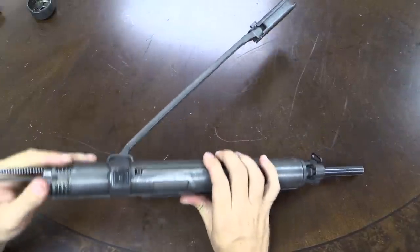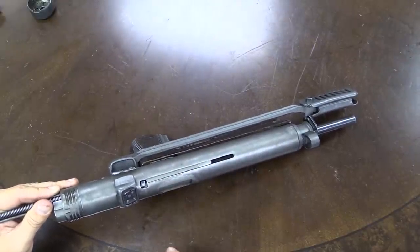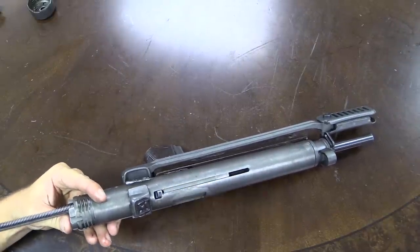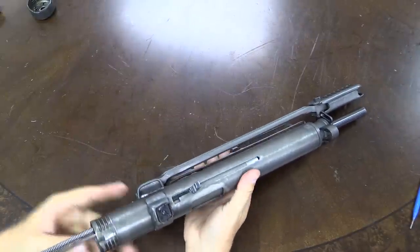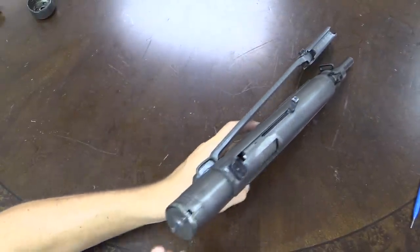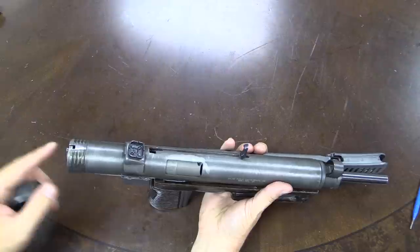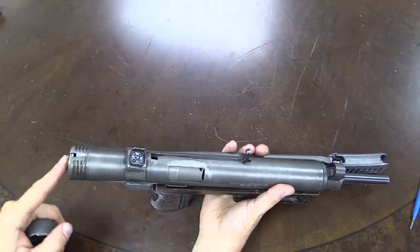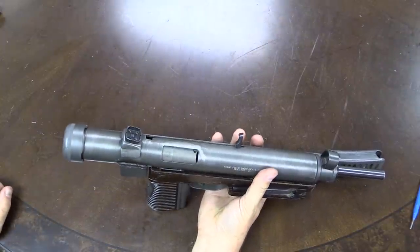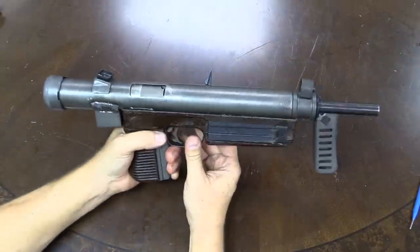This particular gun is a post-sample where the receiver was not particularly well made. The charging handle is supposed to catch on a little ramp in the receiver and automatically pop up into place. However, on this gun the ramp is not well cut, so I have to give it a little helping hand with a punch. Pull the trigger to allow the bolt forward, line up the recoil spring, and put the cap on the back. The recoil spring is captive, so it doesn't launch itself out when you remove the rear cap. Rotate about 30 degrees, snaps in place, and the gun is ready to use again.